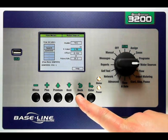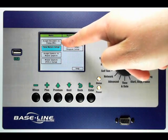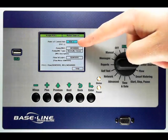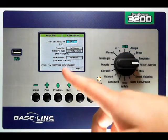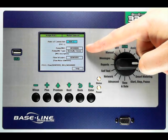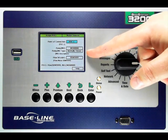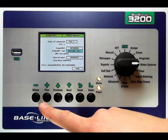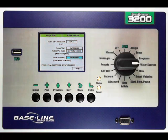Once you've got your flow meter set up, you can then press the back key to go down. Next, we're going to make assignments of our master valve decoders and our flow decoders to this point of connection — assign devices to water sources. I'm going to press enter. You can see I've got eight points of connection here, which I can change by pressing the plus or minus key. I'm going to choose point of connection one. Here I'm going to assign my master valve one, which is the serial number I already assigned previously. It's normally closed, but I can also, with my next and plus or minus keys, change that to normally open. I'm going to leave it at normally closed, and then I also have the option to assign this flow meter to this point of connection as well.